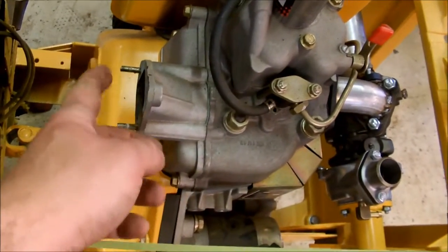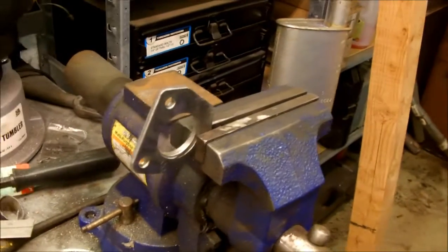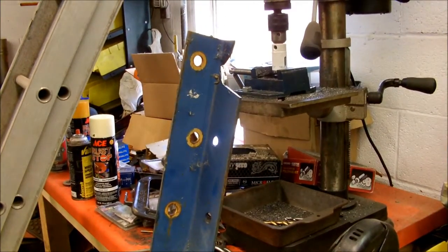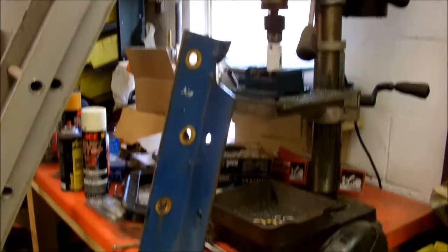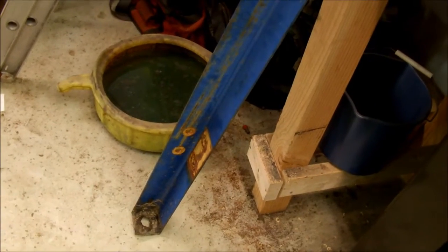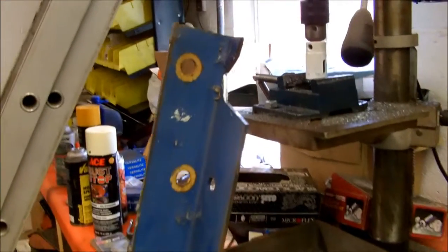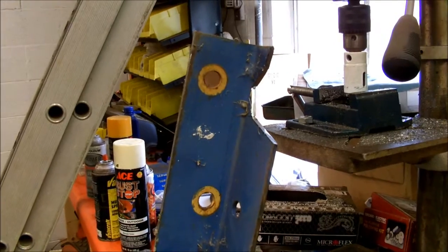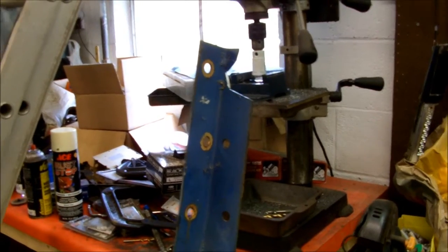What I'm doing now is I just made a flange for the charge pipe to the cylinder head, which is over yonder here. There you go — it's an eighth inch plate. I cut it out of this beam. I've never actually really bought any metal other than small brackets and stuff. I just try and find these beams at scrap places or other big chunks of metal. Hitches work real nice — people throw out hitches when they're rusty and they have big nice plates inside you can use to make this stuff. It's a lot cheaper than trying to buy plate steel. Plus I haven't really found any place local that'll sell me anything less than a truckload.